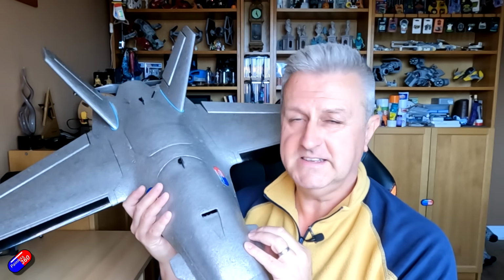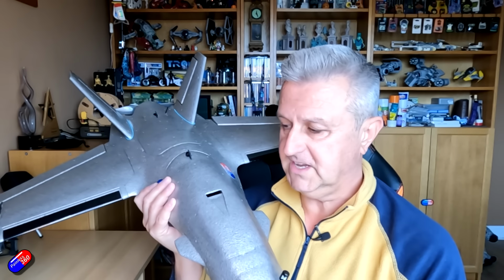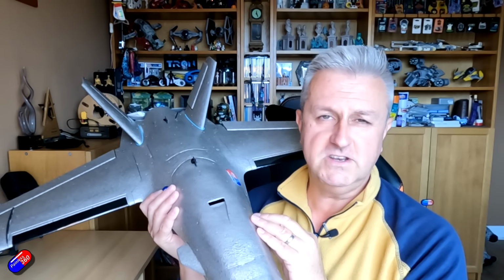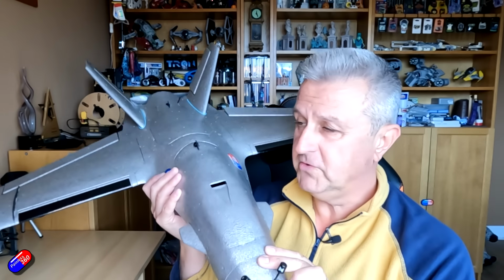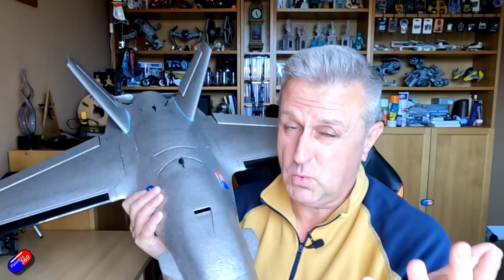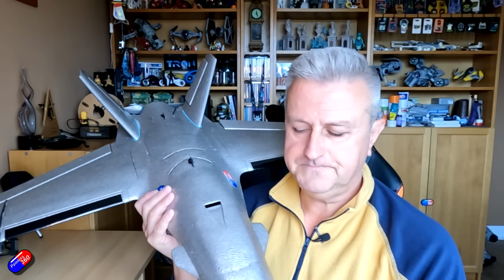The trick for me, as I've mentioned, is that I like to fly in manual to make sure we're all tickety-boo, and that requires a maiden flight for me to fly around in horizon, make sure that all the servos get trimmed properly. Then I can fly it in manual to make sure that the plane is actually set up well in terms of the throws, which I didn't quite get to do yet. Once that's done, then I can go through the tune.